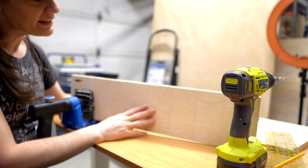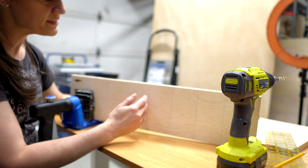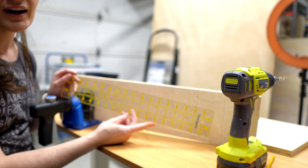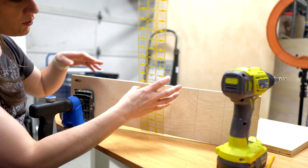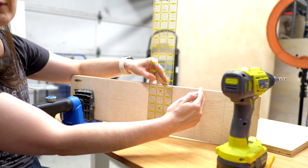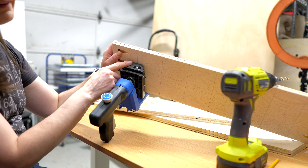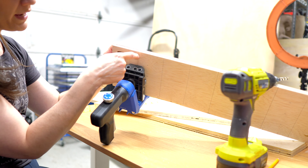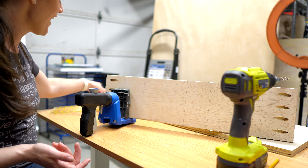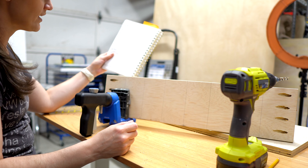After a little trial and error, I figured the easiest way to put in the pocket holes on these long edges was to first measure the center and then use my Omnigrid ruler — it's clear and it's so easy to line everything up. Once I have the center, I just use this — it's three inches wide, and I place them each three inches apart. I lined it up with the center line right here on the Kreg jig. It tells me it's going to put that pocket hole right there, and then I'll have a total of seven holes, which is exactly what I planned for in my original drawing.